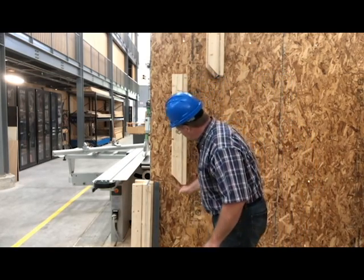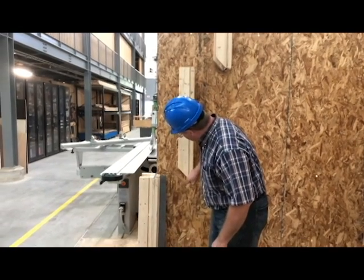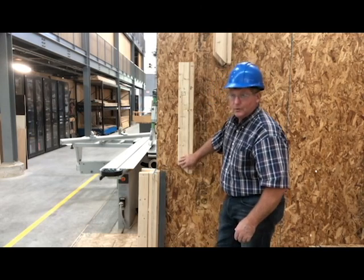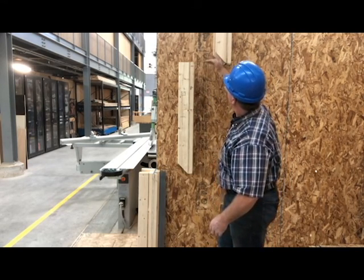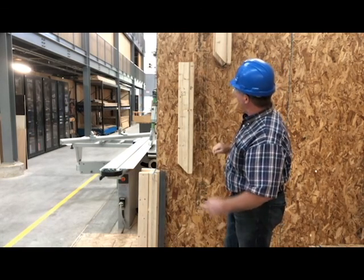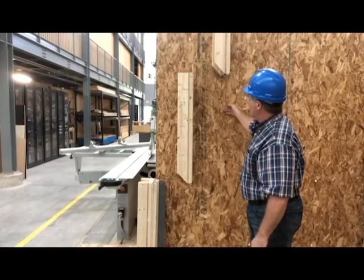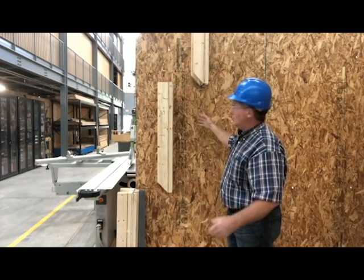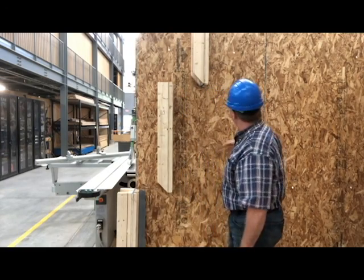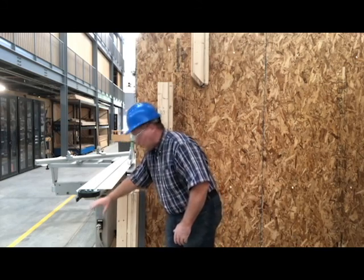Always, when we're finishing concrete, we have to get our trowel in there. If we brought this 2x4 right down flush, it would be on top of the concrete and I can't finish the top of it — so we always chamfer it. This one's at 45 degrees; it could be at 30 degrees. It's in order to get in here and get that concrete finished. You'll do it on stairs also. These are all put on before we put the inside forms up — you'll build your outside forms first, then put all the bulkheads in. They'll be spiked in, and there might be ties going through them.